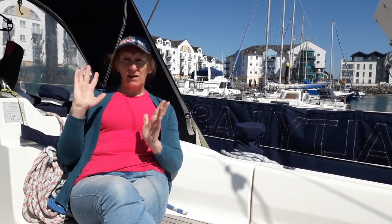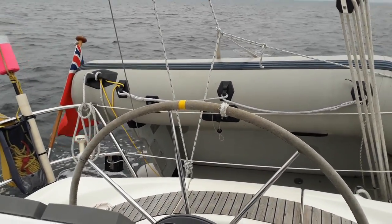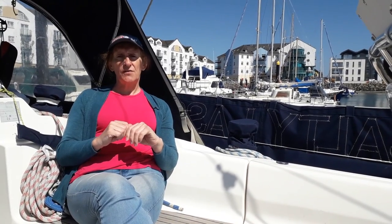In terms of power requirements, which is another question we've had, it depends very much how your boat is set up. If it's working hard in a heavy sea, it will draw a fair amount of power. On a day like this, where you've got the sails fairly well balanced and the boat is more or less steering itself, the autopilot does very, very little other than provide occasional corrections, and because it's doing so little, it probably draws very, very little power. We've certainly never had it drain the batteries or come close to doing so. And we have the solar panels on the back, so even if it was drawing a huge amount of power, they'd be replenishing it as quick as it's drawing it out. The unit is rated at a maximum draw of 7 amps. But I think it would have to be really, really working hard to draw that.